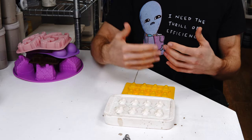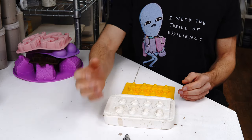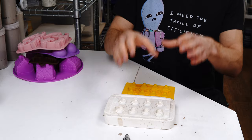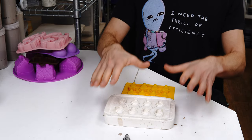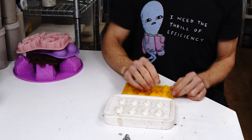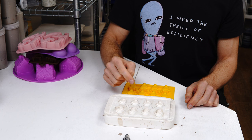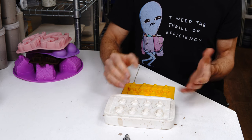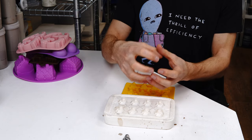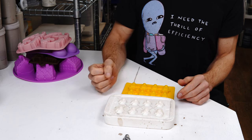When you're learning slip casting, particularly following a guide on the internet, it will generally show you how to make a plaster mould of a found object like a bottle. You set the bottle in clay, pour plaster over half of it, flip it over and pour plaster on the other side — a two-part mould. In my experience you generally get the bottle stuck in one half of the mould because any overhang, anywhere that the plaster can grip, will hold the piece in place. If both pieces are brittle, you'll break one of them getting it out.